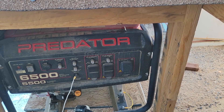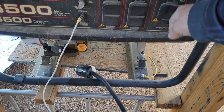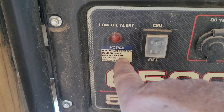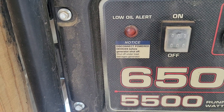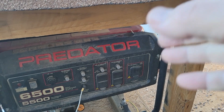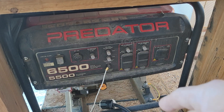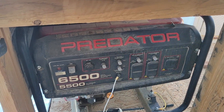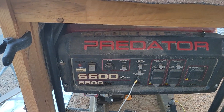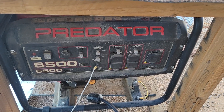The AIMS inverter can act as a battery charger, so I can fire up the generator, plug it in, and that gives me the option to not only run everything in the cabin but also charge my batteries at the same time. The reason I don't leave it permanently plugged in is that the generator manual says to disconnect powered devices before shutting off — shutting off under load damages the generator. So I always unplug it first. There are generators available with auto electric starters that can hardwire into the AIMS inverter and auto-start if there's a loss of power.